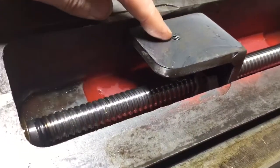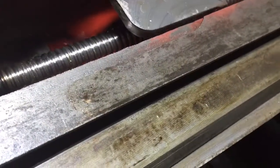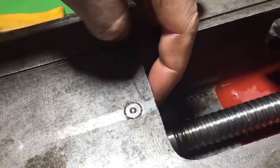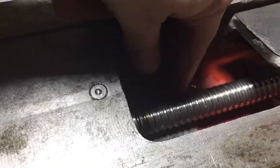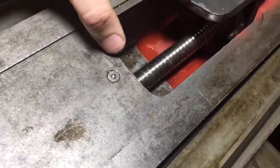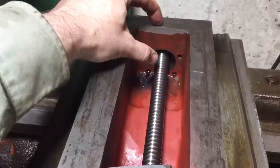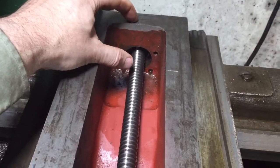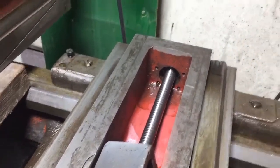The new bracket I was making yesterday connects to the ball screw nut, and this edge here touches this face here before the nut catches on this end piece of metal. Because I was losing motion here I've tried to get as much movement as I could at this end. So maybe it moves an inch less than it did, but the advantages far outweigh the disadvantage on this one.